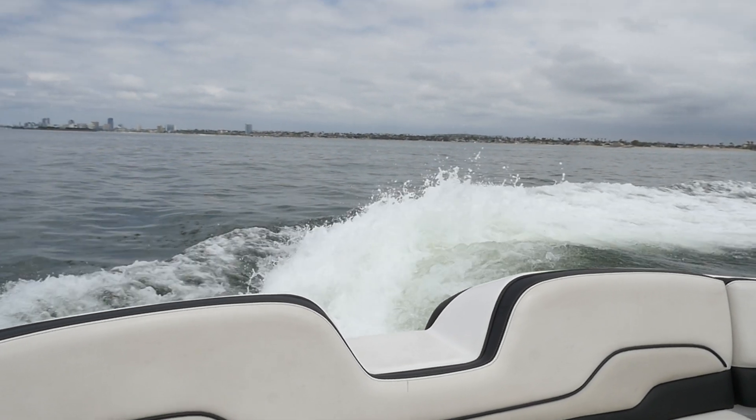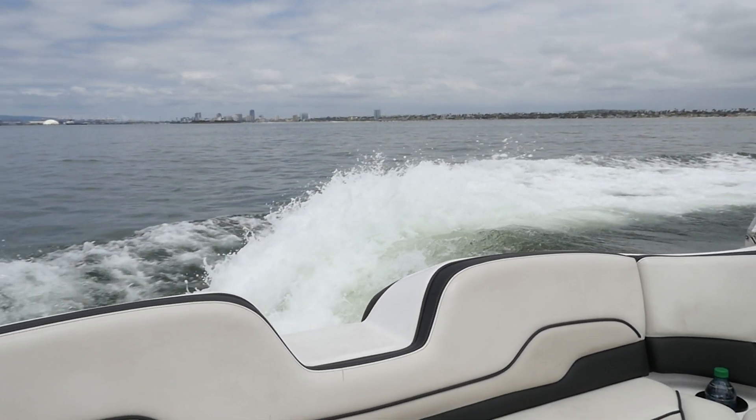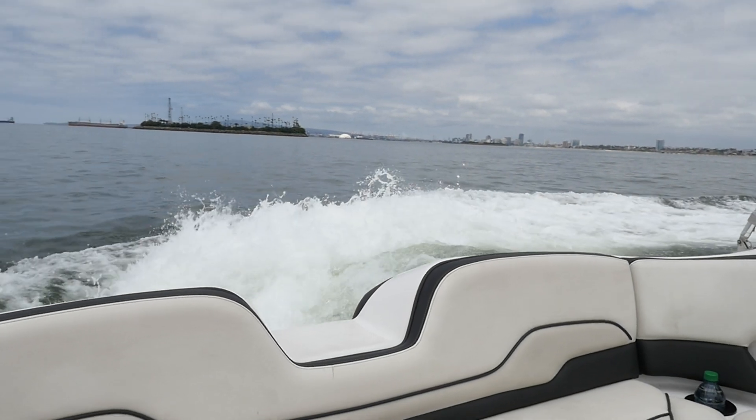Looking towards the future, I now know what we need to fix. The salt releases need to be replaced with a different type of salt or perhaps a different chemical that dissolves more slowly. The housing for the main drop cam needs to be readjusted and remade, because it's proving too difficult to assemble, especially while the boat is rocking. And of course the electronics need to be fixed as well — three main things that'll hopefully make life easier in the future. Armed with this valuable real-life experience, I headed back to Philadelphia knowing exactly what I need to do to make this work.